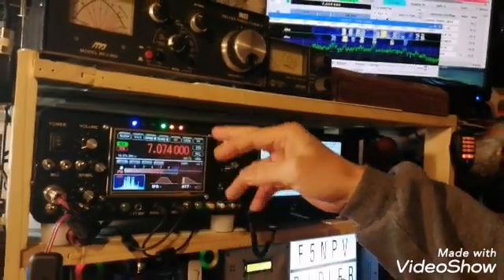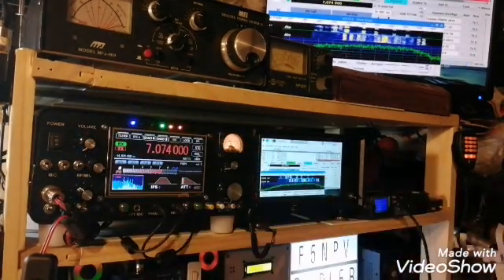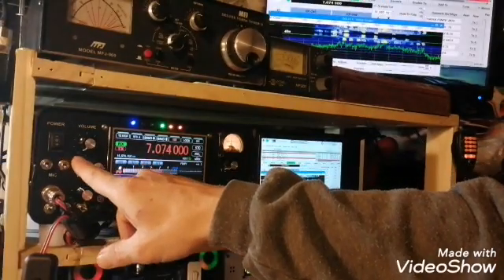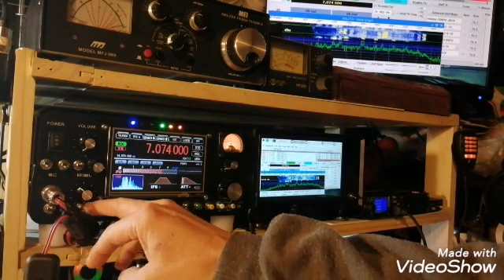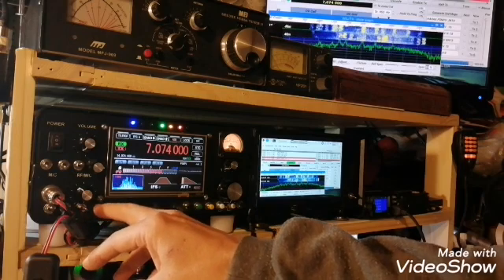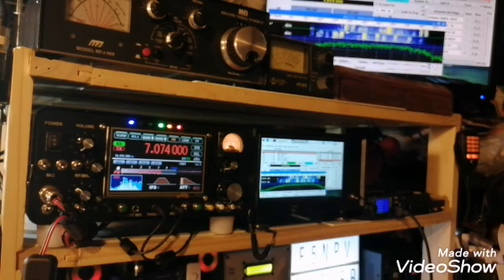According to the features, you also have DSP filtering — you can see I can apply some filtering. There is also the AGC control; I have AGC inside and can switch between fast and slow AGC. This switch is for the pre-amplifier — I have a HF pre-amplifier inside. And there are 3 buttons to control the transverter, the HF amplifier, and additional voltage for the UBTX. I can drive the UBTX with 24 volts to get about 20 to 25 watts output power.